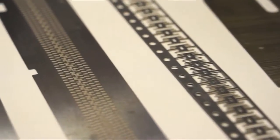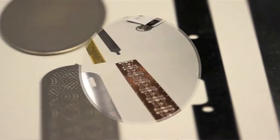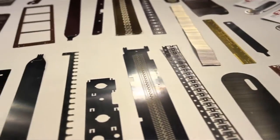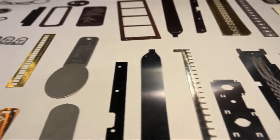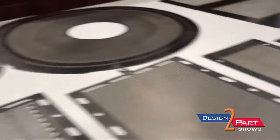The advantage of photochemical machining is you're not work hardening your material, and the thinner the material the better. We range from 60 thousandths thick material all the way down to half a thou — a half a thousandth of an inch thick material — very hard for most companies to machine or to stamp. Chemical etching is really the process you want to use for thinner material.